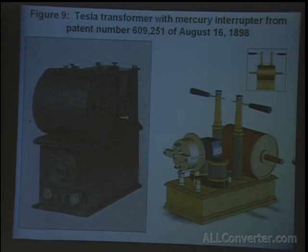It consists of a motor driven hollow pulley containing a small quantity of mercury, which is thrown outwardly against the walls of a vessel by centrifugal force and entrains a contact wheel which periodically closes and opens the condenser circuit. By means of adjusting screws above the pulley, the depth and immersion of the vanes and consequently the duration of each contact can be varied at desire.